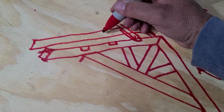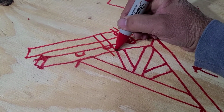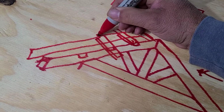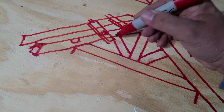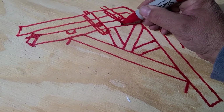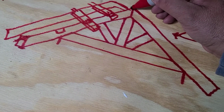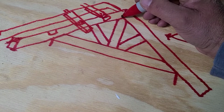So you'd keep adding those on, come out 1 foot past your gable end truss, put your screws through that second truss and then down through your gable end truss, and you do that all the way down, holding 1 foot out. I know it's not to scale, but, and then on top, you would get a longer piece, depending on how long your fascia board is.